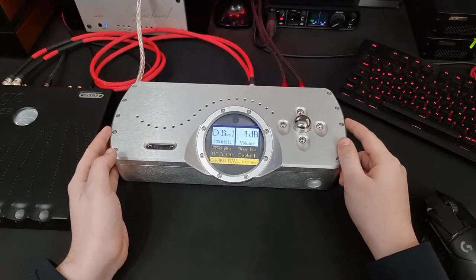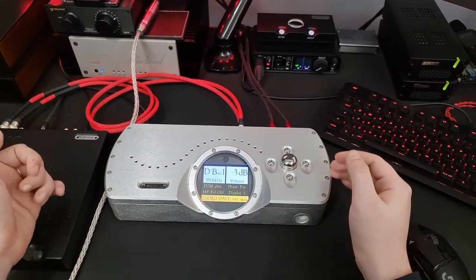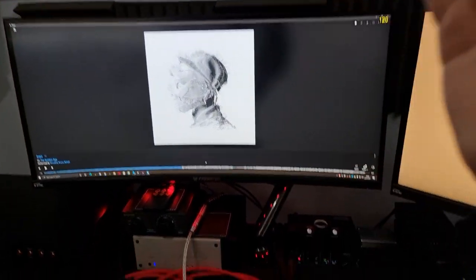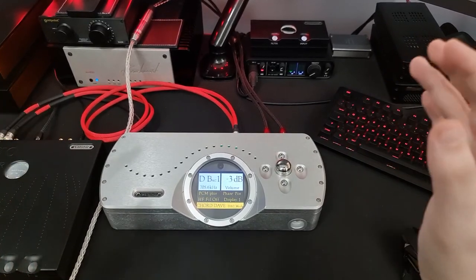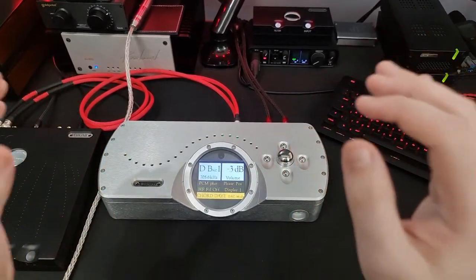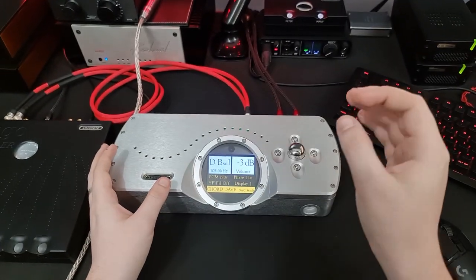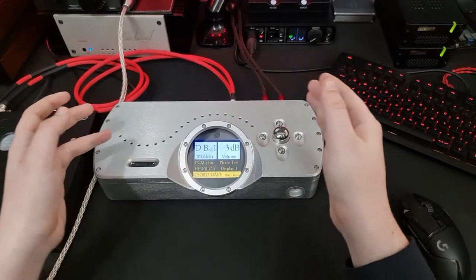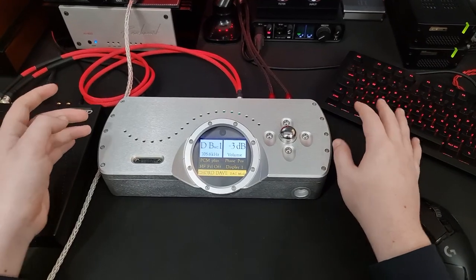That's the first thing that Chord DACs do a little bit differently. The second is oversampling. All Delta Sigma DACs have to oversample. They take the 44.1 kHz information you give them and they add extra samples in between to bring it up to a higher sample rate. All Delta Sigma DACs do that, and the maths you use, the oversampling filter that you use to do that, matters. The number of coefficients that that filter has, called the tap count, matters. Chord goes above and beyond in that regard.